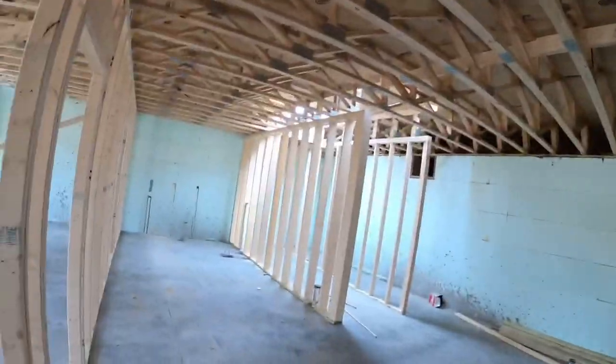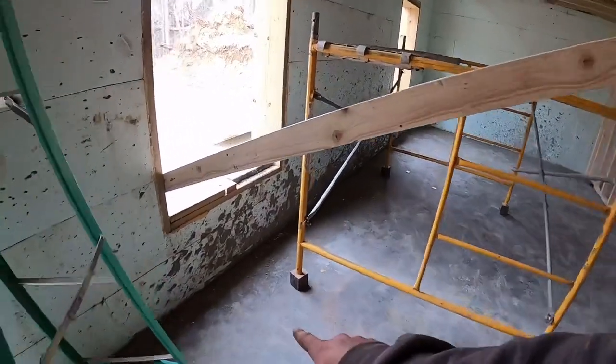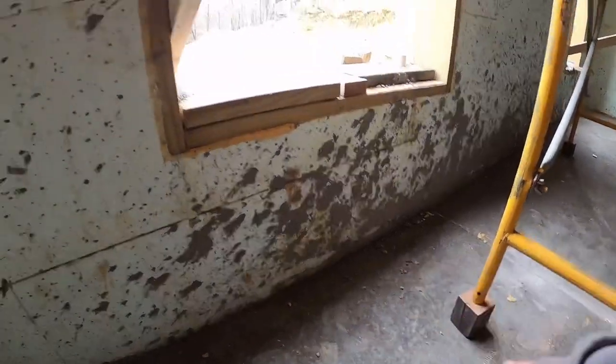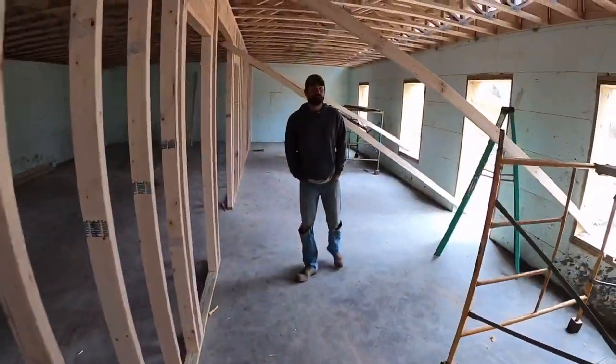Usually you can take a drywall knife or a putty knife or a scraper or something, go down the wall and get that off there. My experience from finishing concrete on these, you can almost see it right here. You see that line right there? Whenever you got concrete splattered up on the wall, and you run the trowel machine down through there, the trowel machine knocks it off, and it makes it really hard to finish along that wall. So we usually try to keep from doing that, but there you go. That's the trowel machine line. It knocks that off. But all in all, I'd say it looks pretty good. What do you think? I think so.